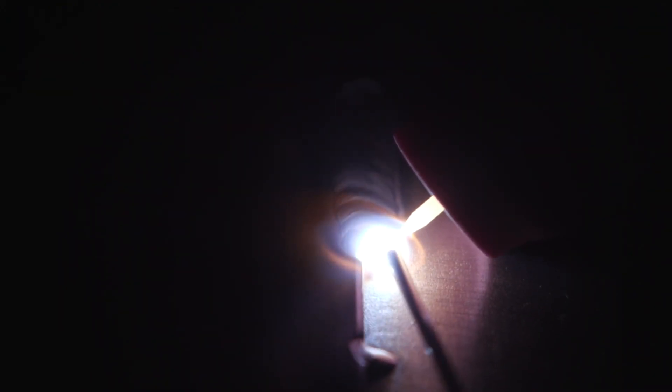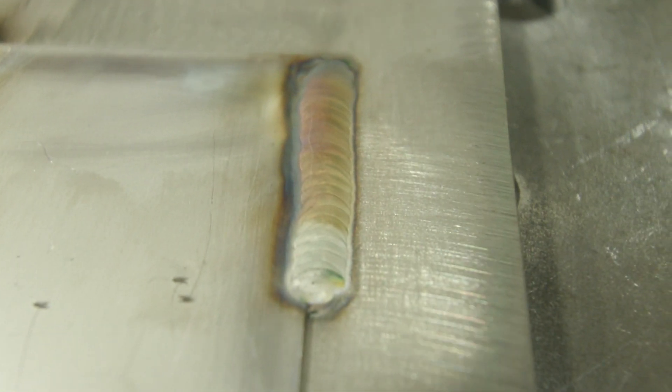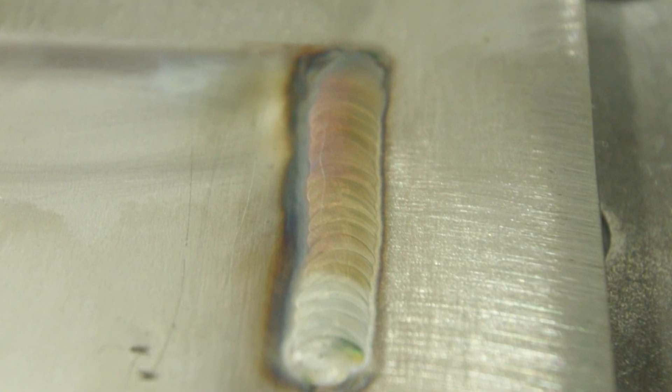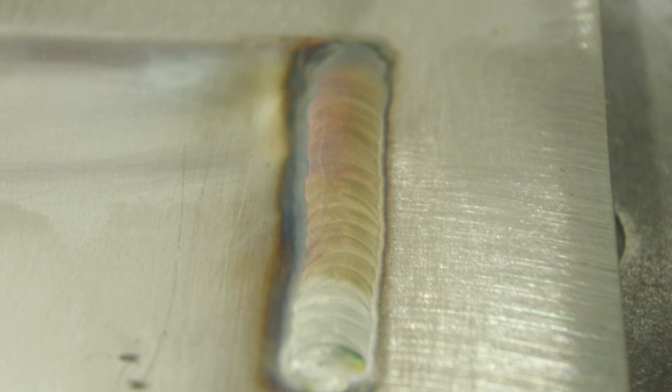As you can see it's still flowing and everything's going along pretty nice, but you can see how that puddle is pushing way far up onto that thin top plate — I don't want that. I want to keep a nice, tight, concise puddle just right up to the edge of the top plate, the thinner material. This reinforces why you want to keep your tungsten pointed towards the thicker material: it helps dissipate more heat, gives you more control of the puddle, and prevents you from eroding so much of that thinner top plate.